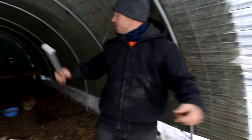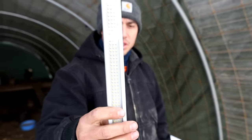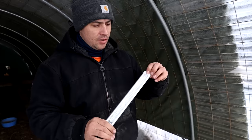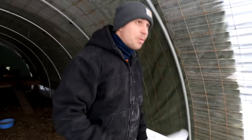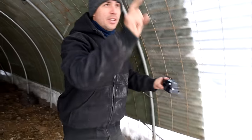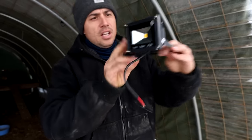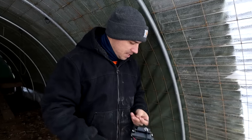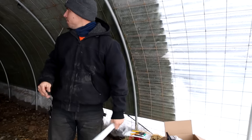The plan is to light the outside of the chicken coop — which we call the run — and also the inside. These are the lights we're going to be using: LED strip lights, 12 volts. They've got a positive and negative and you can hook them directly to an automotive battery. They've got an on/off switch, but we're going to hook them up a little differently. We're going to do four of these outside here and four inside the coop. We've also got another cool light for the outside of the run so you can see the door when you're walking in, and one on the outside of the coop — almost like a floodlight. This one is 10 watts and those are 8 watts total. With the lights and the diesel heater, we should be under 100 watts of power when everything's up and running.